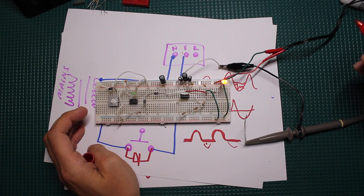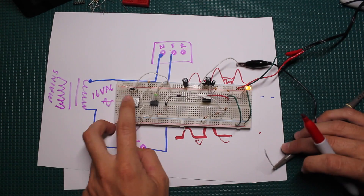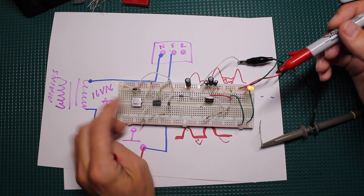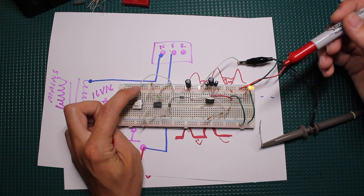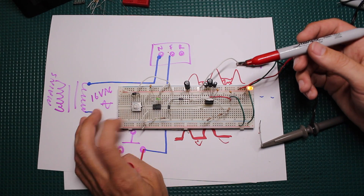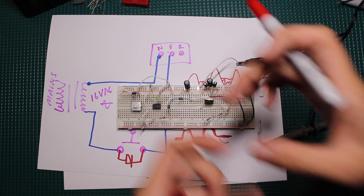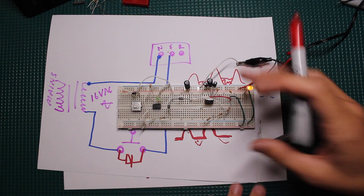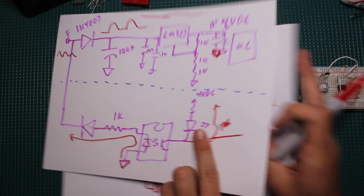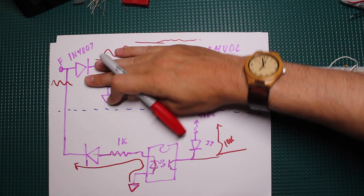Here is the circuit — we'll look at some waveforms as well. I have a 12-volt AC wall adapter, which is standing in for the 16V AC. I've got a little push button over here. You can see we've got continuous power through the system — this is simulating what the push button would be. I've got the diode right across it, an LED which is my always-on power indicator, and when you press the button I've got a green LED showing that I can detect it.